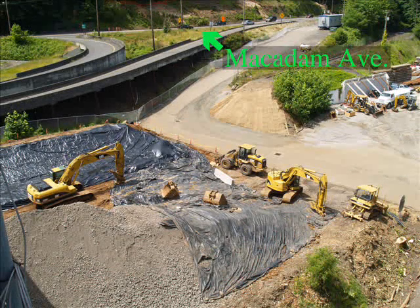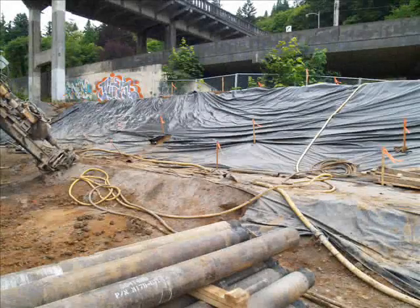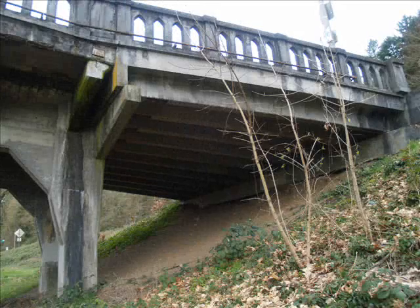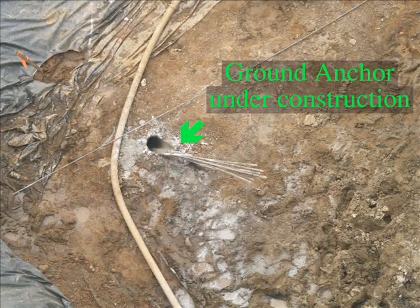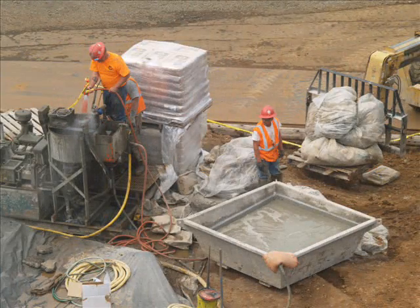west side riverbank. What basically is happening now is they're starting the landslide mitigation work, which is going to be this huge underground system to tie the bridge and the land that sits below it onto bedrock, to connect it so that the movement of the landslide won't dislodge the bridge and the interchange in the future the way it has in the past. So there'll be these underground ground anchors that go like for over 100 feet at a 45-degree angle. It's a very expensive and major part of the construction project that people will never see.